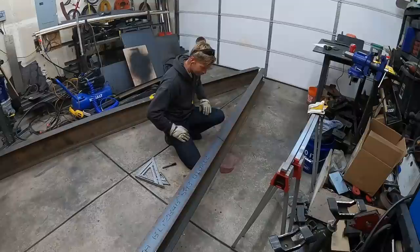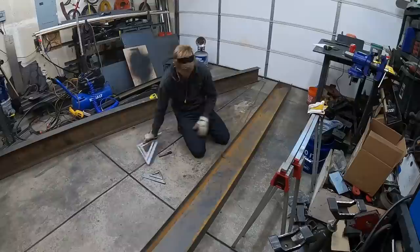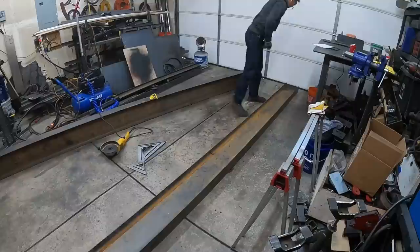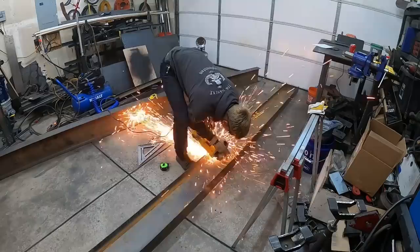We'll probably reinforce around the area where one might park a skid steer or a forklift, with some runners lengthwise in between the cross members, around the general width of a skid steer or forklift. They're about similar width, so we'll just throw some extra supports in there. Around the axle, maybe just in front of the axle, because if you're going to haul just that one item, it'd probably be positioned just forward of the trailer front axle. So we'll reinforce that, but we're going to end up with a really nice trailer.